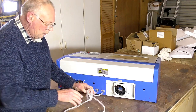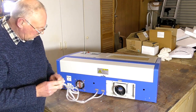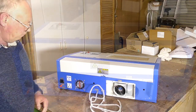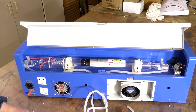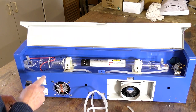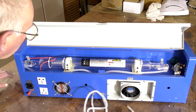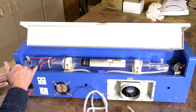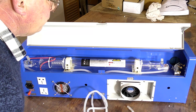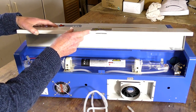This is the laser tube coolant housing — the laser tube is inside here. On other models the lid immediately falls back down and everything is tied up with zip ties. The laser tube looks fine — I know that in shipping quite a few will snap off on the inside, but this one looks fine. The mirrors also look fine, but we won't know for sure until we actually get it running.